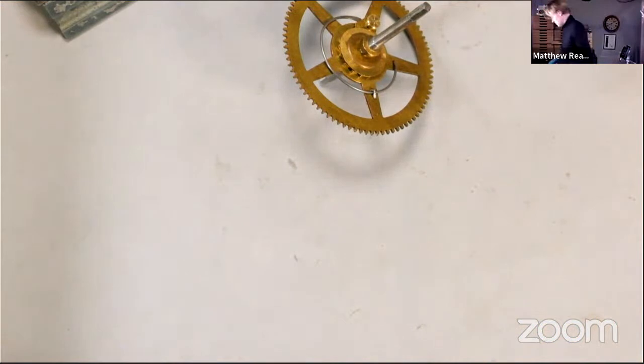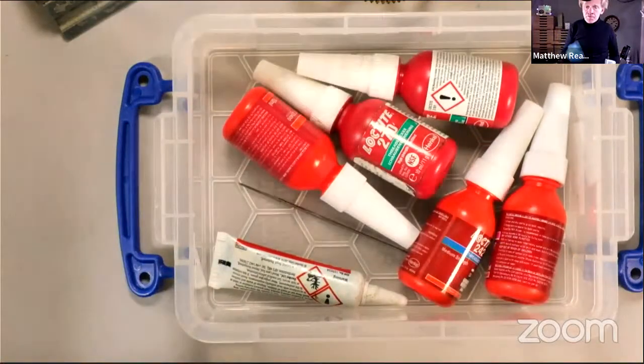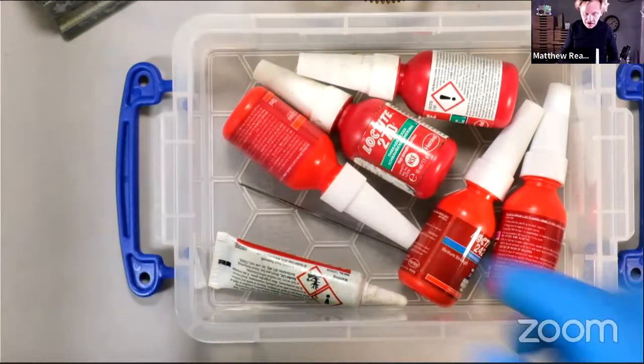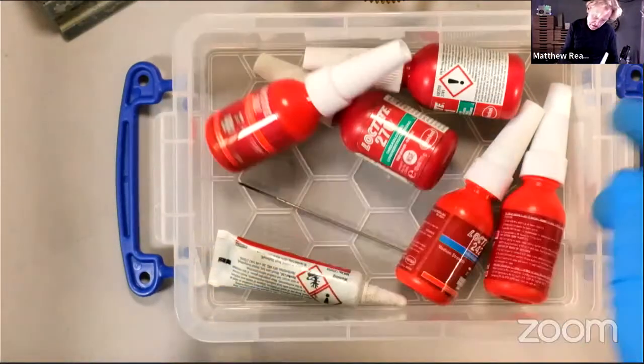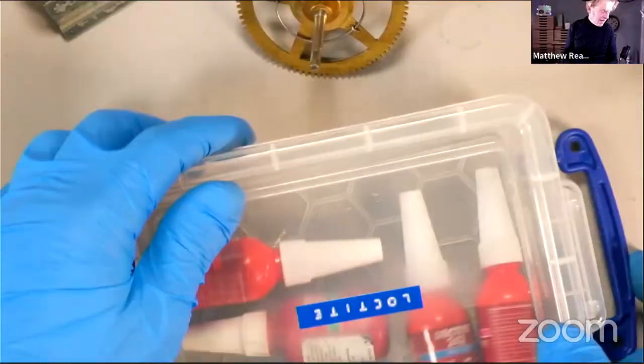No, let's just find it. No, same thing. Sorry. Yeah, Loctite's just the, they used to call it, well, they probably still do call it thread locking compound. I presume the word stud lock comes from studs in things like car cylinder heads. But as you can see here, Loctite is a trade name of Henkel, a registered trademark, but there are all kinds of brands and they do all different things. Some are for incredibly specific purposes. I'm going to use 2701 here, which is my kind of favorite one.